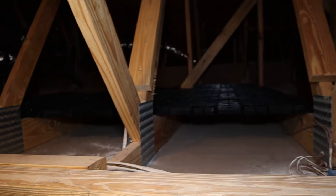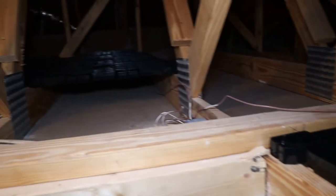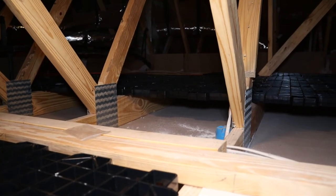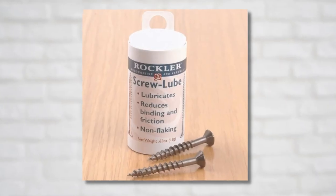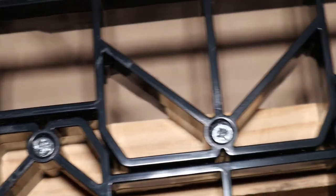I just finished installing all of the attic deck panels — let's go check out what it looks like. I installed all 32 deck panels in three different areas of my attic. They're pretty simple to install and light to bring up the ladder. I do have one quick tip: towards the beginning of the installation I stripped several screws. After about the first six or seven panels I implemented a method that significantly reduced stripped screws — using a screw lube around the screw so they go into the wood more easily. I didn't have screw lube, so I used Vaseline and it worked well.